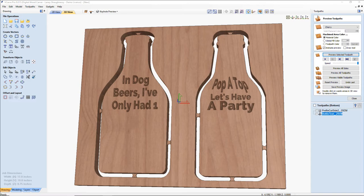Are you referring to high density foam board? Because if you're getting high density foam board for $7.50 for a 4x8 or 2x4 or 2x8, that's phenomenal. A 4x8 sheet of high density foam, 1 inch thick, is $495 a sheet. So I would love to know where your source is. I might have to talk to you about that later, Dennis. But if you're talking about high density fiber board, that's a different story. High density fiber board makes a great waste vacuum table.